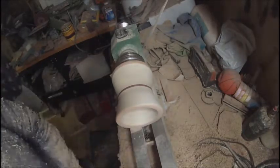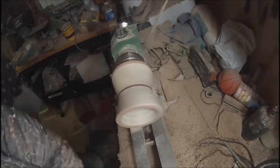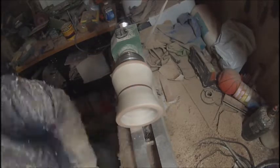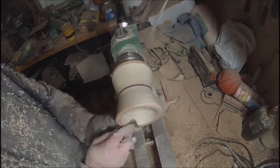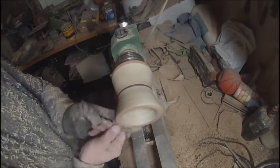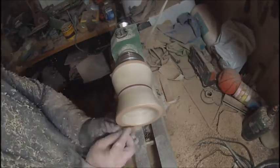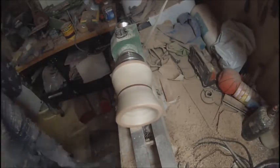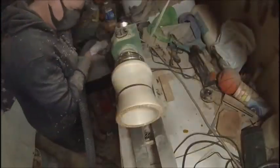Here I start out with the 220 grit sandpaper, move to a 500 grit, and then eventually go to a thousand. If you really want to make things shine, do the work and do the sanding — because once all those pores are closed up and you're adding your shellac or Obie Shine Juice or wax or whatever, it definitely makes a difference. It's just time, and it's easy stuff anyway.